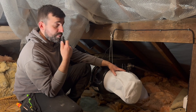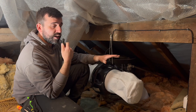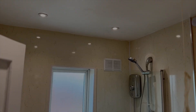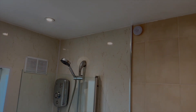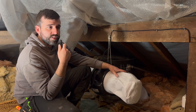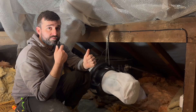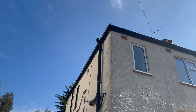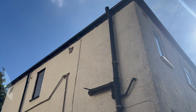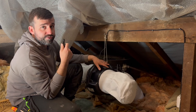The reason we've gone for a PIV unit in this instance rather than a traditional extractor fan was that the bathroom is already tiled and finished, and due to the unique way that this house is made, there are no gable ends for us to take an inline fan ducting through, and there are no fascias and soffits for us to exhaust it through. So we were a little bit stuck with what to install, and we suggested this PIV unit.